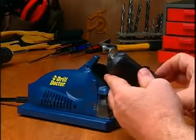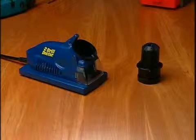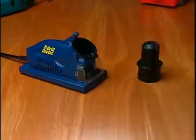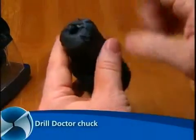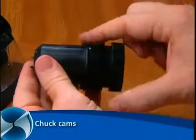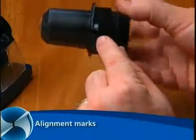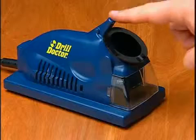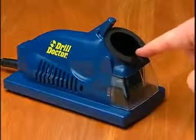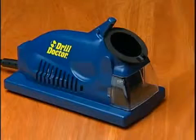That's all there is to sharpening bits with DrillDoctor. The key parts to the DrillDoctor are the chuck with onboard alignment and the sharpening port. The chuck has chuck jaws that hold the bit, the chuck knob that tightens the chuck, the chuck cams that create the sharpening motion, the sharpening guides (the white lines) for sharpening, and the triangles for alignment. This is the cam guide. This is the sharpening port — note how the sharpening port rocks back and forth. And this is the diamond sharpening wheel. This is the cover you remove to replace the sharpening wheel.